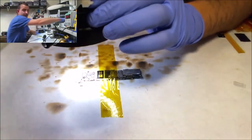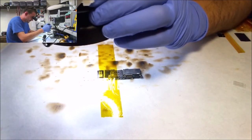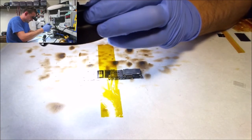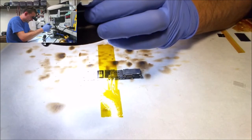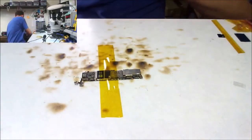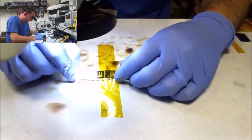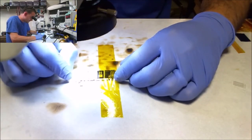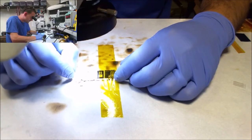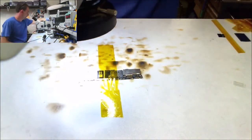I'm going to move in nice and close with the big scope. I'm going to turn up my light and make sure this is all nice and flat. Well, aside from my couple of little dings where I got a tiny bit of solder in the connector, it looks marvelous. Clean it up. For the sake of testing, try the alcohol. And then I'm going to test it.